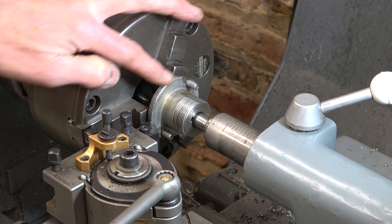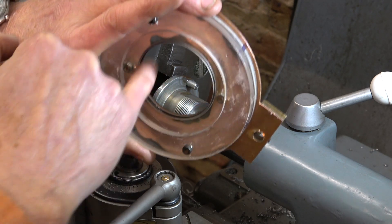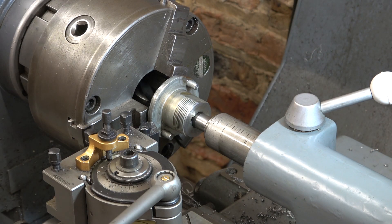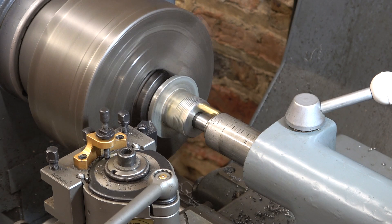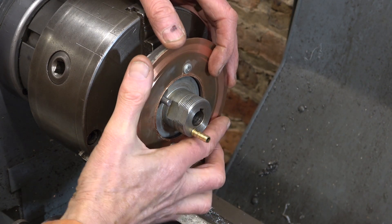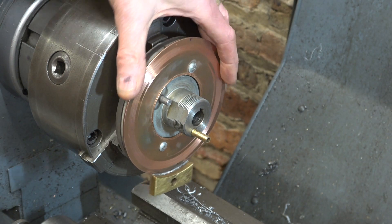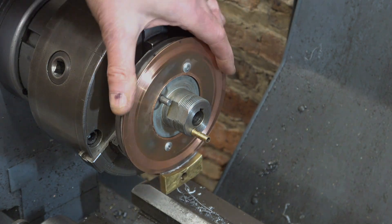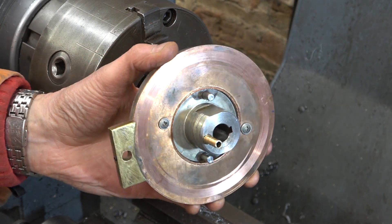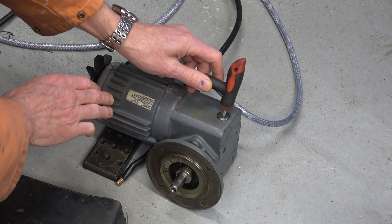I'm just going to take a fraction off here so that it's looser against that seal. I can't believe this would be causing the motor too much trouble, but I've put so much work into this I may as well get it right. I've taken about 0.4 of a mil off this diameter and it just nicely eases on — there's very little drag compared to what there was, because it really was quite tight. It stays in, but it turns easily now. I want to have a look at the oil in the gearbox.